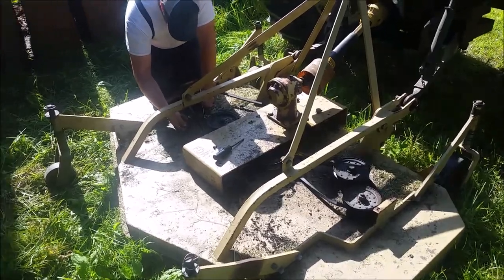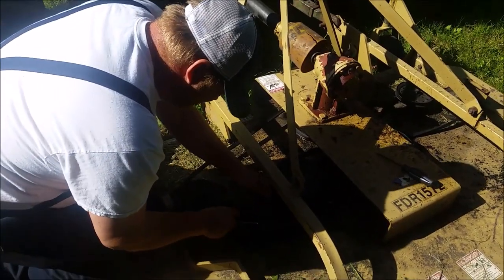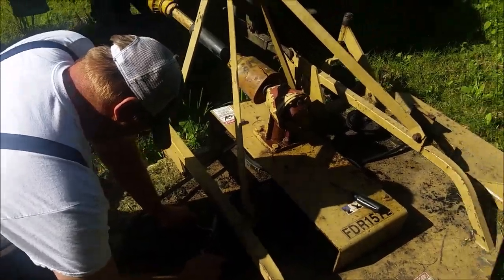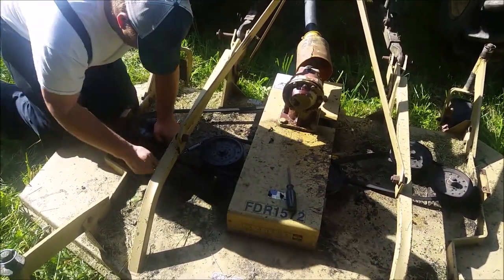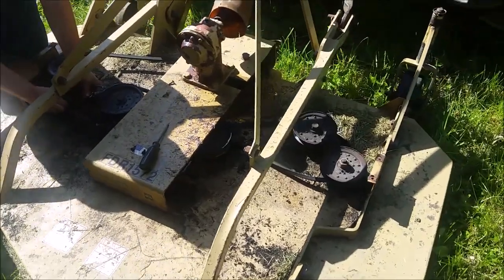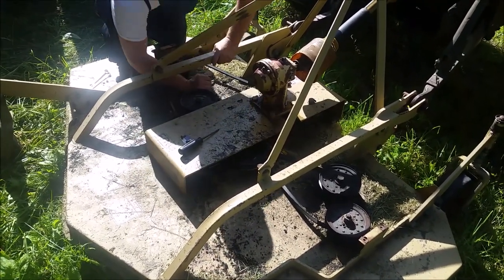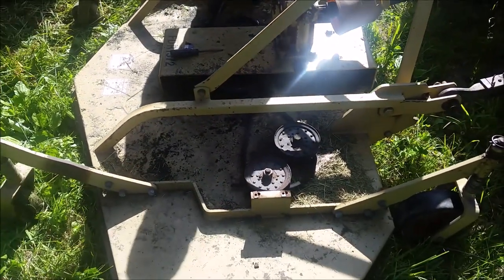We may have to raise the deck to keep going, or I'll get the brush hog out. With used equipment there's always little things — the spring they had on here wasn't doing anything, so he swapped it out. Maybe we didn't have the tension quite right, or maybe the grass was too tall. We're loosening it to get the belt back on because it twisted when it jumped off. It took me about an hour trying to find the right diagram for how the belt goes on — it's a really long belt, and finding which way it goes through the pulleys is a challenge. Even on their own website there are lots of different models, but we found it.